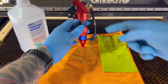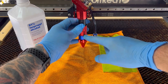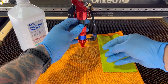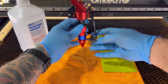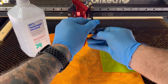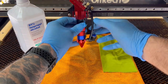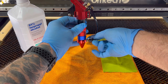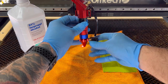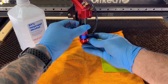Let's pretend for a second that this laser nozzle is actually mounted to my gantry. Your lens is going to be found in this location, and to gain access to it you're going to want to start by removing the air line. You do this by pressing down on the blue portion right here, and then simultaneously pulling up on the air hose till it pops out. Then turn your air connector down so it's out of the way.